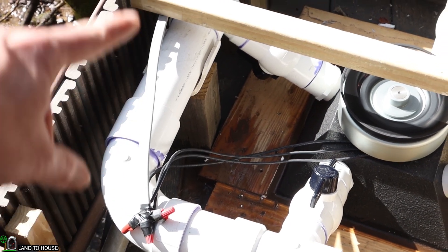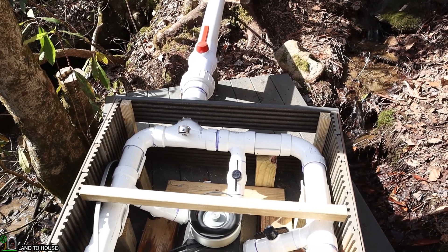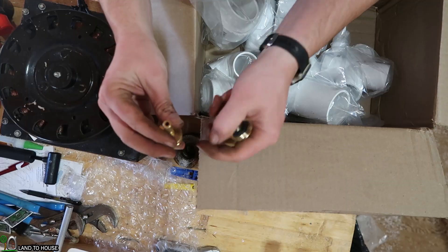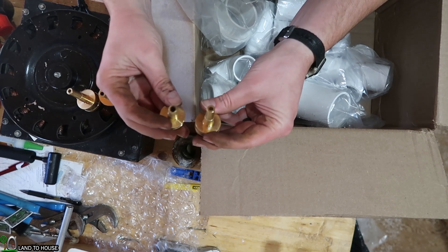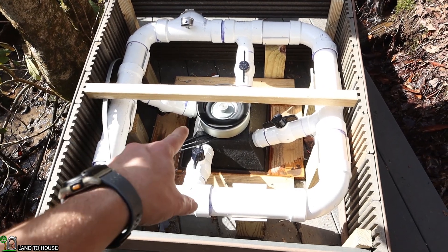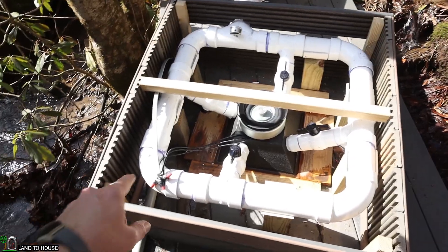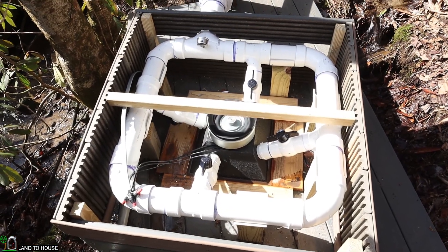The wire goes on to the house. The incoming line is four-inch and is carrying about 110 gallons per minute. It reduces down to three-inch pipe, which comes all the way around, and then reduces again to two-inch pipe. Each of these four sections has a nozzle attached, which pushes the water down to a very small size — two of them are 16-millimeter and two are 19-millimeter — and that water pressure is what spins this turbine. You want to have as little air in the system as possible and as little friction in the pipes. That's why they're using these big sweeps out here on the side to allow for water flow without any real reduction in pressure.